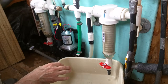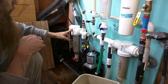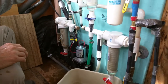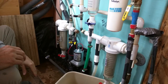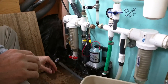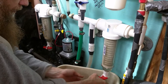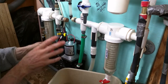Open this up and now listen carefully to the pump. It'll sound good for about half a second and then get quiet — because as the air bubble gets sucked in it's going to make it lose prime. The pressure tank is off so it should pressurize quickly, but that may not be the case. Nice and quiet — so it's lost prime. Let out the air — you can hear it there. Now you can hear it struggling, dealing with air.